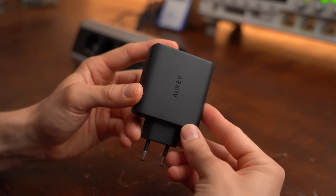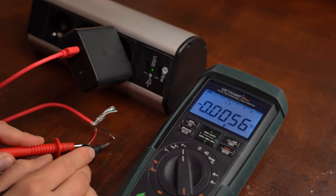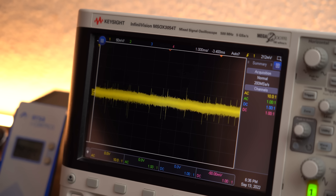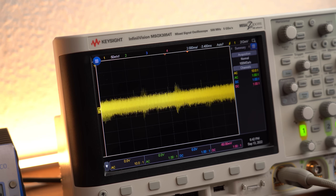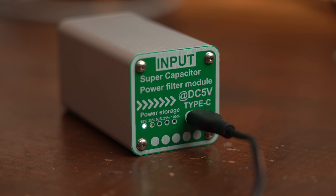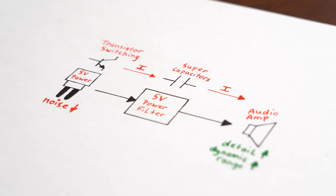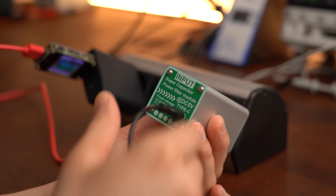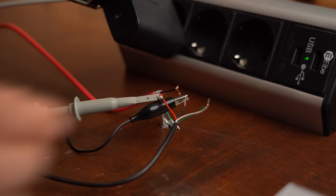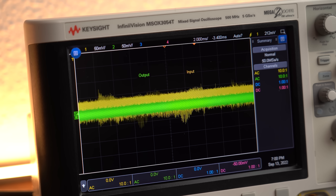As a power source we often use small switch mode power supplies which, like the name implies, do a lot of switching on the inside to create a usable low DC voltage at the end. But the switching creates quite a bit of unwanted noise that is especially noticeable when drawing current. So this filter might be capable of getting rid of that by simply charging up its internal supercapacitors, out of which we can then draw clean noise-free power. Let's try that by connecting the 5V power supply to the inputs, a constant load to the outputs, and observing the voltage while drawing 500mA. And yes, the filter does in fact reduce the noise problem.